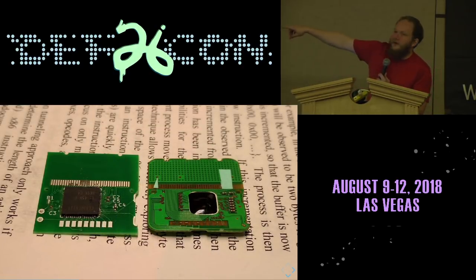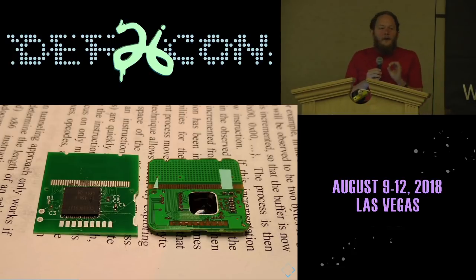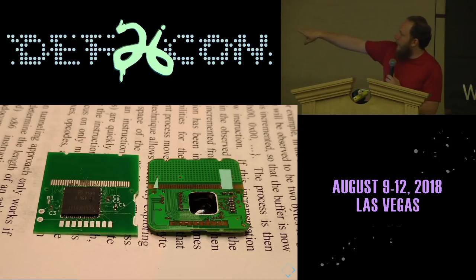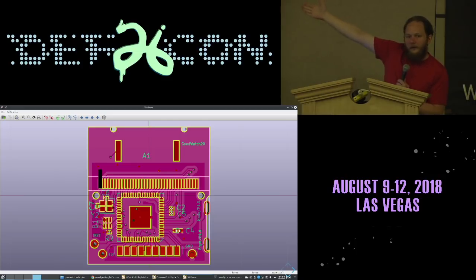And I recovered these by using sticky tape, or the little sticky notes. You take a razor blade and you chop off the end of it. And then by sticking this onto the PCB, you can selectively introduce a failure in a single pin of the LCD. I had to do this because I don't quite have enough LCD pins on my chip to drive all of the pins of the physical LCD hardware. So I needed to find which pins I could block off while keeping every digit of the display legible. To figure out which pin does what, you just introduce failure in a whole bunch of them at a time. So with the black bar there covering the far west pin, I now know that a quarter of the LCD pixels will refuse to light.